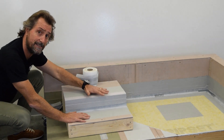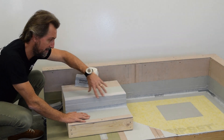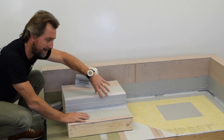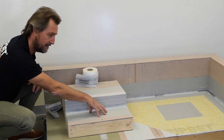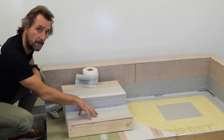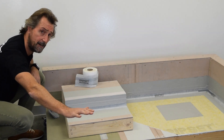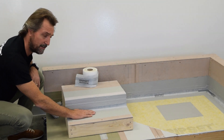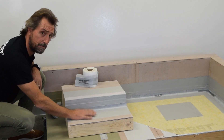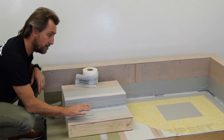Once that's finished and waterproof, the other trades come in and place their window and door on top and get all that section done correctly. In the event any damage happens to this section, it's okay, because the waterproofing will come back later and tank the rest of the balcony area. That waterproofing will overlap this as a seamless finish, damage can be repaired, and the waterproofing should happen just before the tiling finish or the screed.